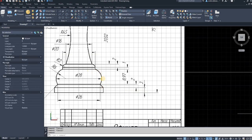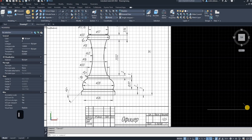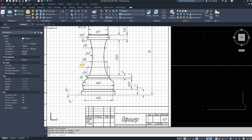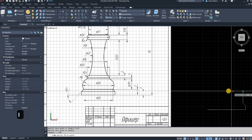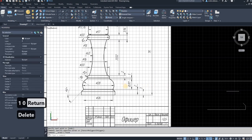The circle right here — I know the height of the circle is going to be 8.97 as shown. I'm going to draw a line of 8.97. To draw this arch, you need two points. The top diameter is shown as 20 millimeters, which gives a radius of 10 millimeters from the center. I'll use the center as one reference and that point height as the other, then draw a line of 10 millimeters to get my two points.